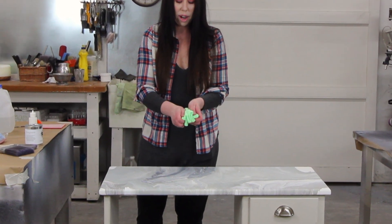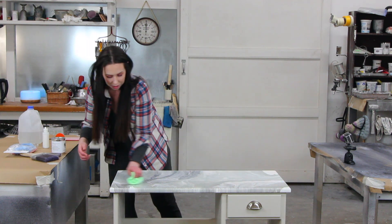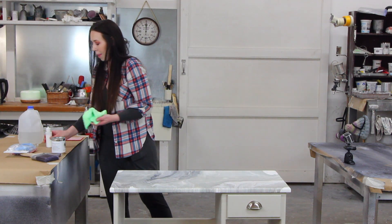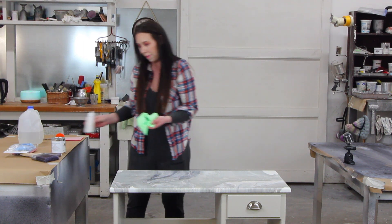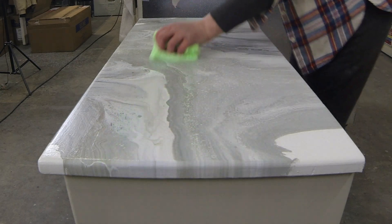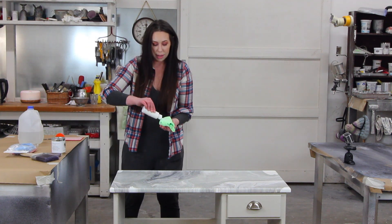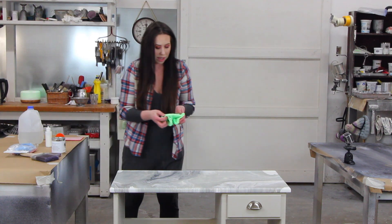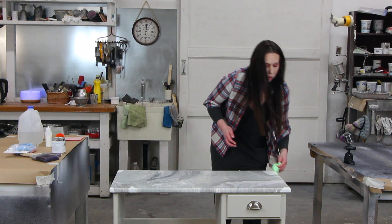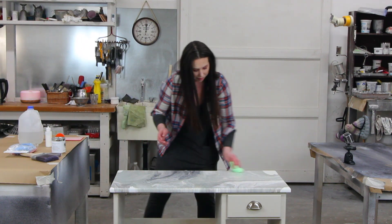When I apply it, I just go from one end to another and heavily saturate the cloth. Next, massage the product in so you don't get a heavy area. You'll notice I'm overlapping slightly and I keep loading my cloth over and over. After a while your cloth will start feeling a little bit heavy and you know it's good and saturated with sealer. The nice thing about applying it this way is it's really fast and it leaves a nice even thin coat — you don't have to worry about brush strokes, drips, or runs.